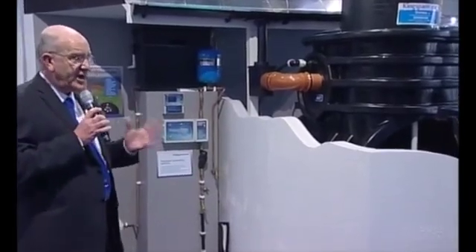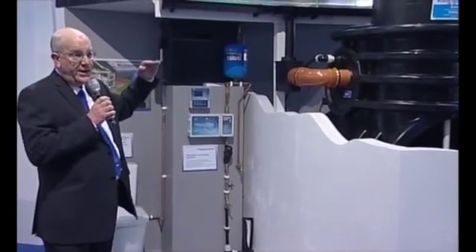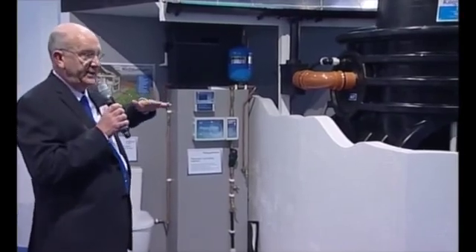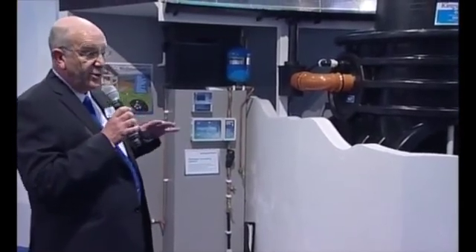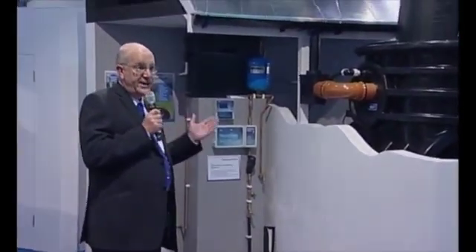The other part driving this is that if you're building inside any London borough at the moment, they will ask you to use rainwater as high up the hierarchy as possible. If you're building under a London borough, there's a plan called the London Plan which you'll have to build to. A lot of authorities that have experienced one-in-100-year rainstorms are also taking the same steps, so it's going to become more of a planning issue as well.